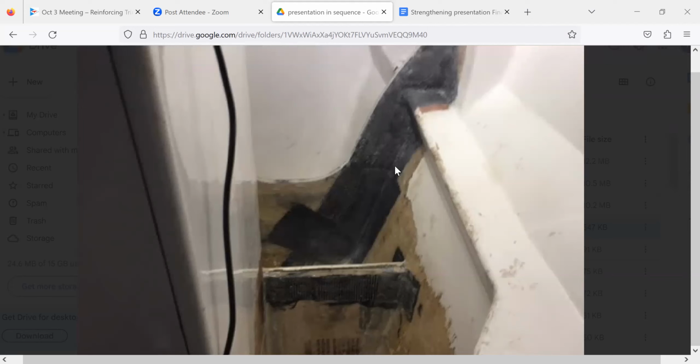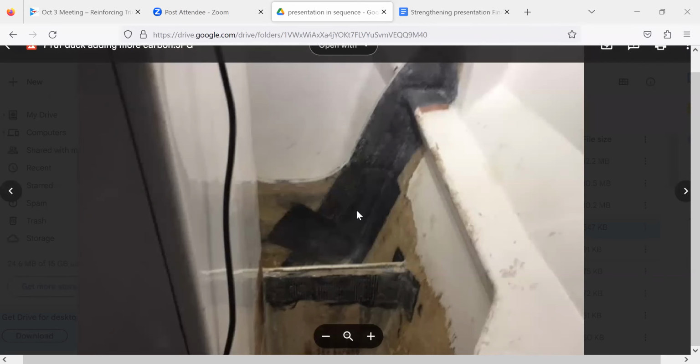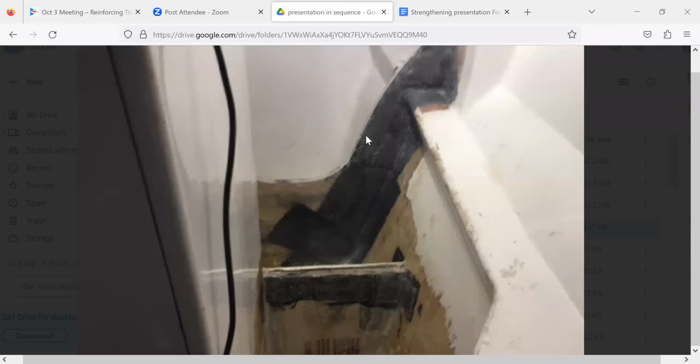All this stuff, the uni is just on the bulkhead part, essentially making that beam. And then everything that I bonded from the beam to the flat to the hull was all biax. So 45 as it hit the hull gives you a stronger bond, you have all the fibers resisting the pull, plus it bends easier. If your 90 would be oriented perpendicular here, your strength is really half the fiber because all the fibers going in this direction aren't doing anything. So I did go over it with biax. This patch down here is biax as well. And then I think I put some uni in here, and then all the tabbing was biax.